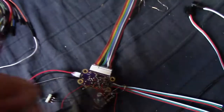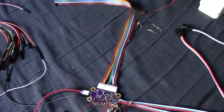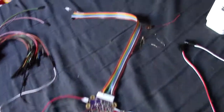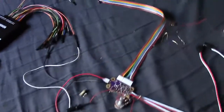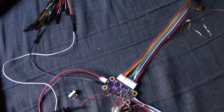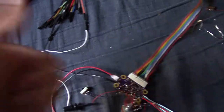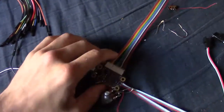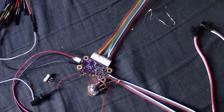So that's one of our options. Bleeder resistor, awesome. And I think if you add one in the very high range, you know, the 2000 ohm range, you're doing pretty good, right? You aren't burning off a ton of power. You're helping that slope a little bit. It's one method, one option to include in your arsenal of ways to do an effective power on reset.